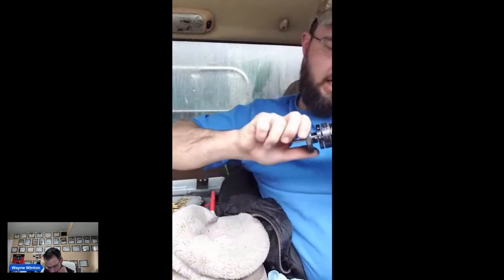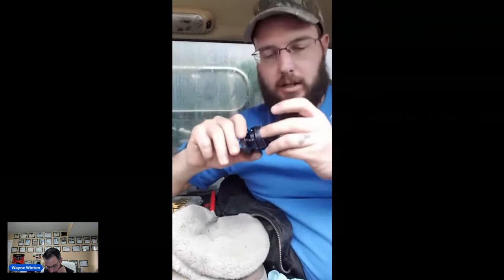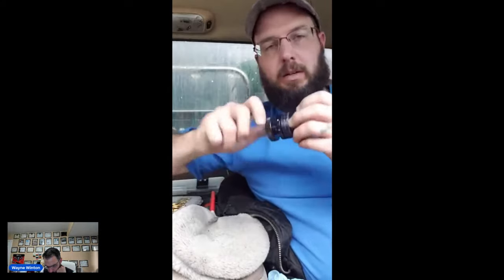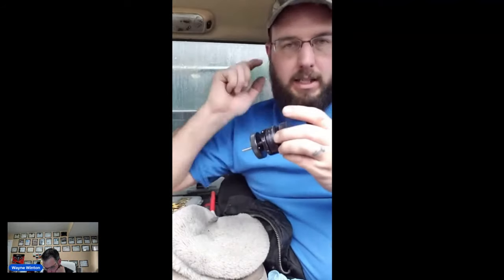Grindy, grindy, grindy. Use all of your senses. Feel it cutting. Look at it cutting. Watch it cutting. Hear it cutting. Notice the sound of the cutting that it's making. Notice the sound when it's not cutting anymore. Feel the difference in pressure and the difference in the grit when you're grinding it. Keep all of these senses engaged while you're watching, listening, and feeling, and then you're going to know what's going on with the machine as you're trying to use it.